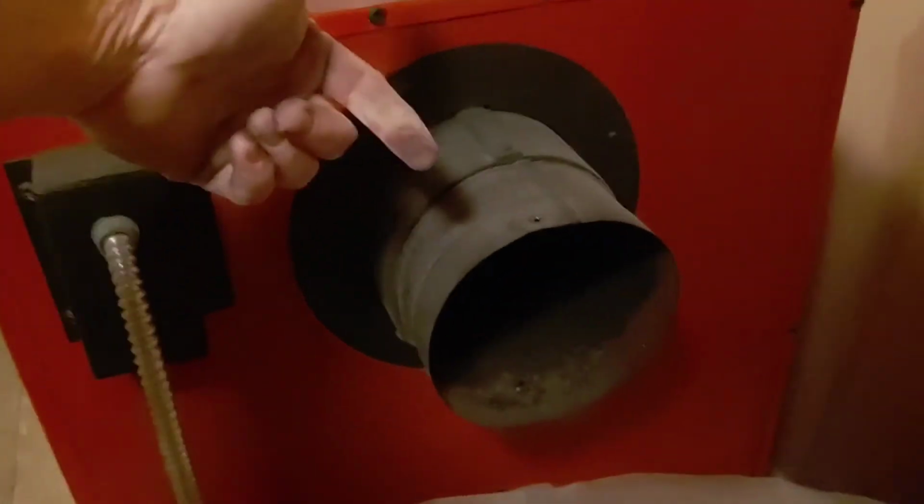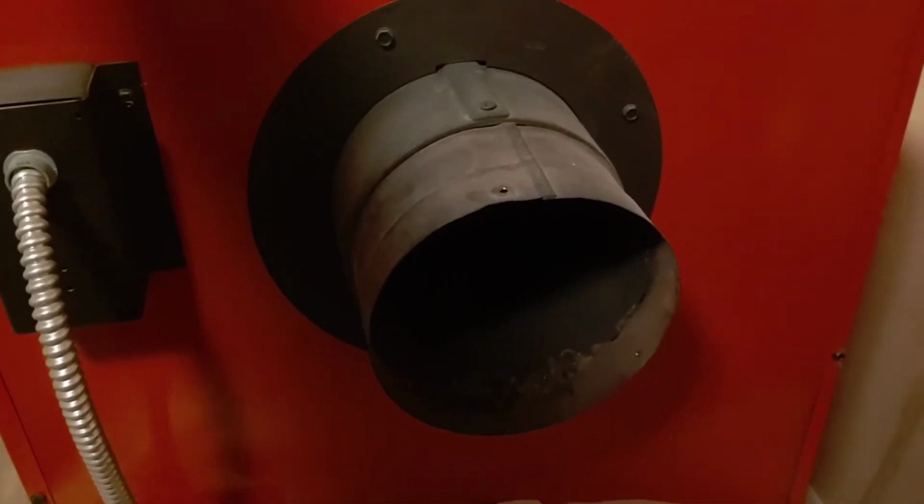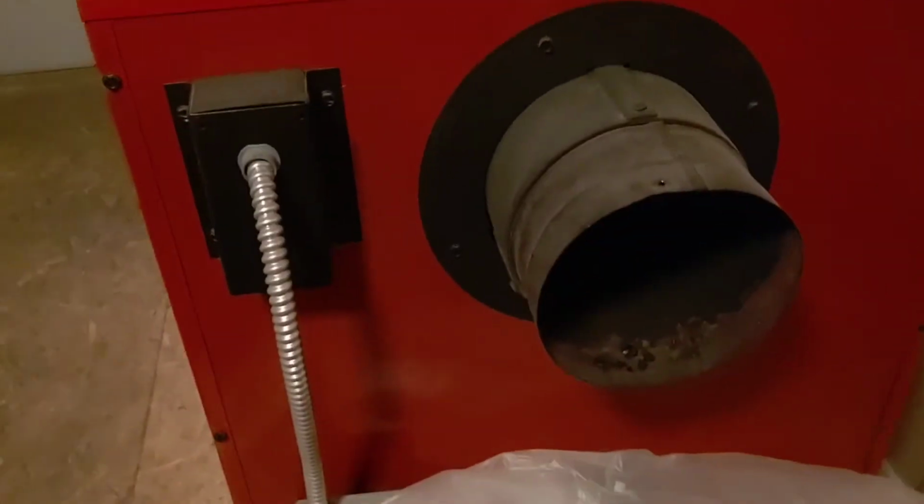And I do have a brush coming to where I can come in from the top of my stove. And it actually swivels. They make a brush. I did not know they did one like it. I thought I was going to have to make something where I can come in from the front of my stove, push it in this elbow, which will be right here. The elbow goes right here, like this, and go up in here to the flue. And now I've got my flue, my damper is about right here. We're looking at about the 18-inch mark above here. So that's where I'm putting it in. From there, from here to the pipe that I got out there in the building.